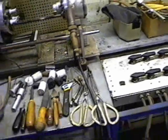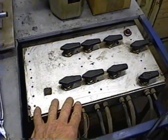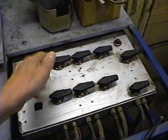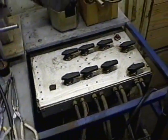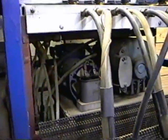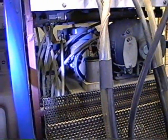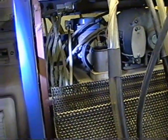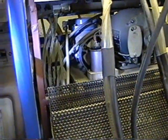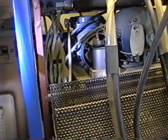We have to have a source of gas and oxygen for the torch. I've rigged up a manifold so you can leave your torches adjusted and all you have to do is turn the manifold on and the torch is ready — just light it and go. For gas we're using natural gas. The gas coming out of the wall is at about three ounces of pressure, but we need about three pounds of pressure to operate the torch. So we use a small diaphragm compressor to compress the gas up to three PSI, regulated by a small bypass regulator.